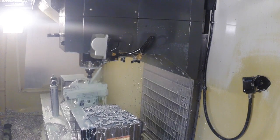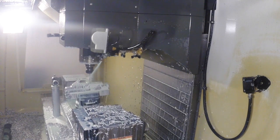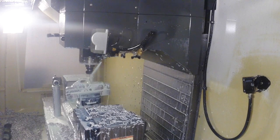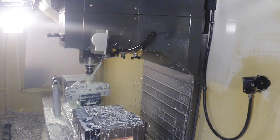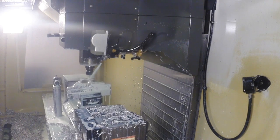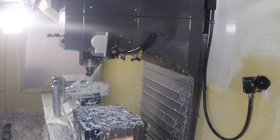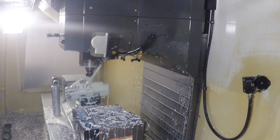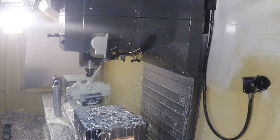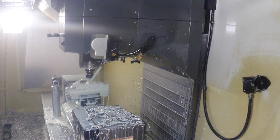Now it's going to do the clearance for the mag release, coming in with what I think is a 3/16ths end mill — long because of where we have to go. There's really not a great way to do this. We can't flip it up on the other end because the tool holder would crash into the part. That's one thing that's tough about 5-axis machining — you have to really watch the workpiece, the vise, the trunnion table, and tool changes. There are things we could do to make this faster, but we're trying to be safe on the machine and materials, and we will speed it up as we go.